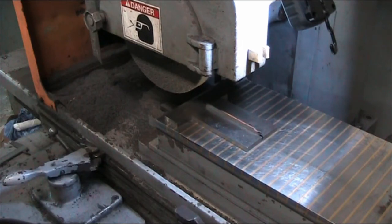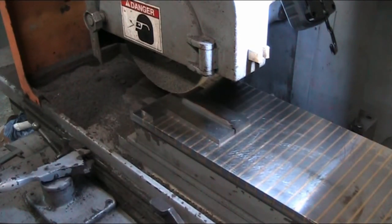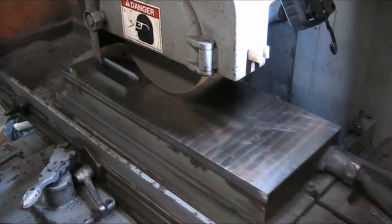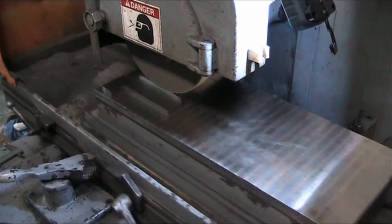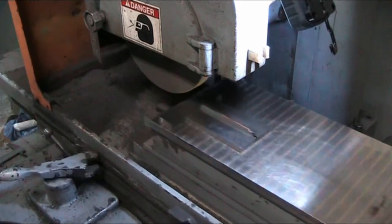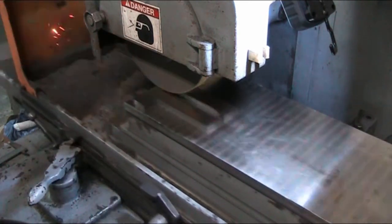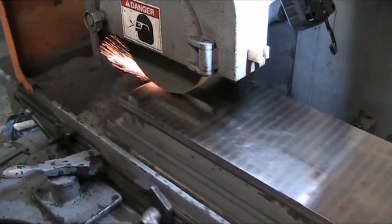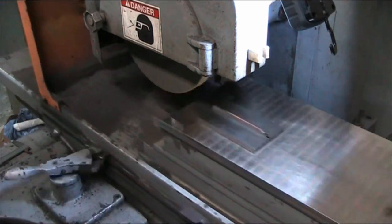Now we'll back this out here. So now we're ready to rock and roll. And been having to do here also, because this is such a narrow workpiece and this is a wide grinding disc, is as it advances, of course, the material wears away underneath the disc, so I've been having to advance the disc as it feeds past it. You don't want to do that on a wide workpiece, but with this narrow stuff, that's pretty much what you got to do.